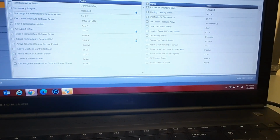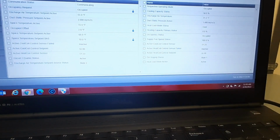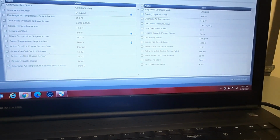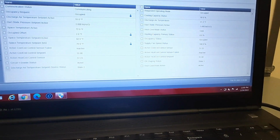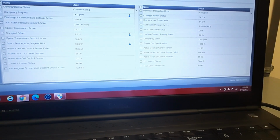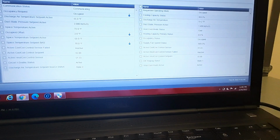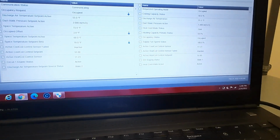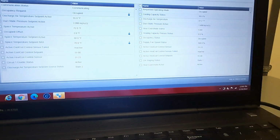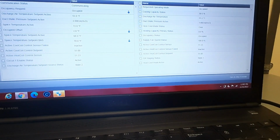Actually, I went in 5 full turns to get my static where it is now. And just before I had the correct meter, I was unable to accurately check my amps, and I was kind of fighting the same battle they were. I'm not sure what meter they were using. I was using a cheapo meter. It's a true RMS, but I could tell that it wasn't very accurate. So I didn't want to overload my motor. I did the best I could with that, getting the static up, and it's been a whole lot better, but we're going to solve a lot of our problems if I can get that static up a little more.